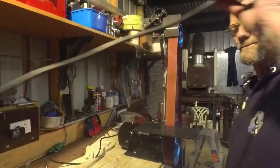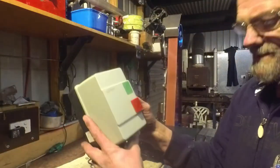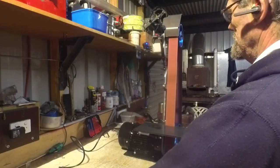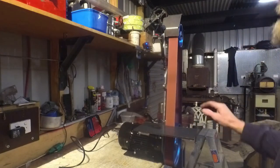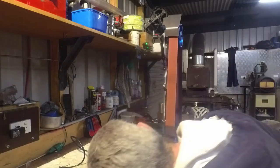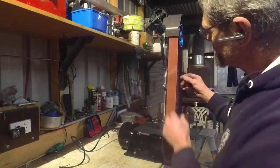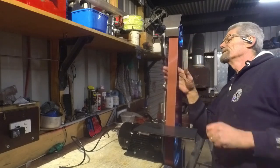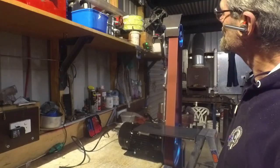Hit the stop button here — it's not mounted yet, but I'll just hit the stop button. So this is it guys — let's see if this thing rotates. That is beautiful. That is tracking perfectly on the belt, beautifully down the side of the platen. Haven't touched it since doing it by hand. Love that. I'm very happy with that first start. Just runs beautifully on the tracking wheel. Platen is sitting perfectly. No click from these beautiful belts. Just perfectly stable — no vibration whatsoever.